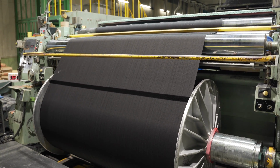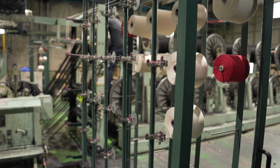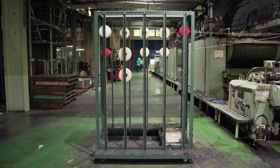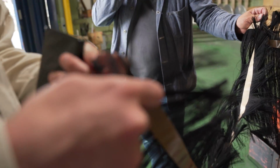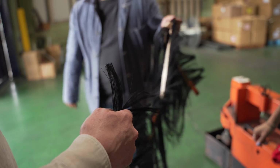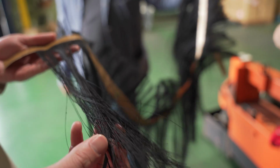Next, ropes are transformed into flat sheets of yarns using a large metal comb, and the Selvedge ID yarns are added to the edge of the beam. After beaming, yarns are given a starch coating to increase strength and tension for weaving. The yarns are going to become a selvedge denim.